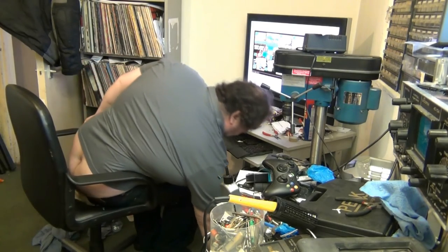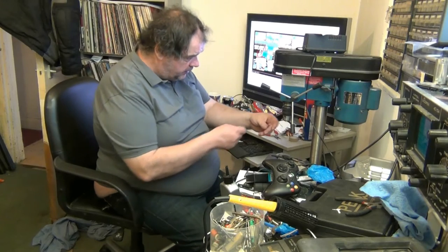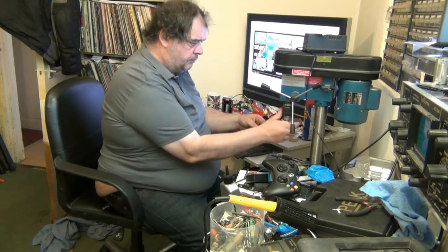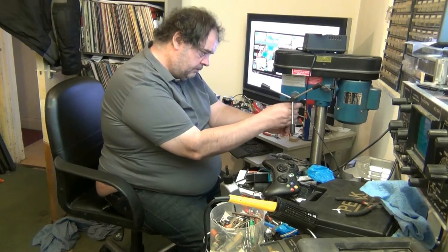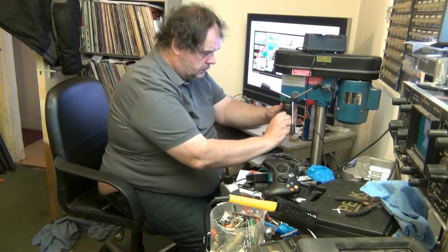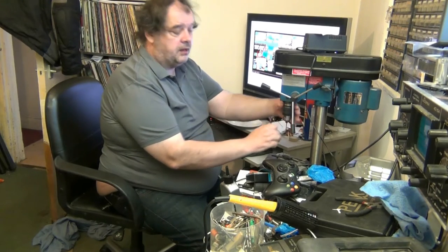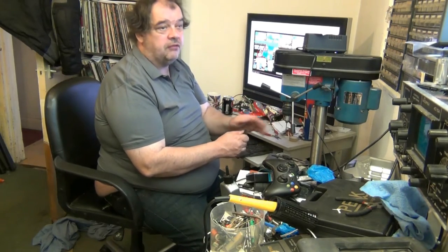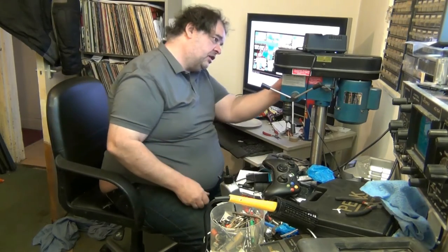I'm about to make it complicated because where's the chuck key? There it is. Basically all I want to do is drill the heads off the rivets. The drill was going the wrong way around - there we go. Let's put the bit into the chuck. When people use these drills they put the chuck key in, turn it, wind it round to the next hole - but the holes are there for convenience, you only need to use one hole. Now let's turn the drill on.